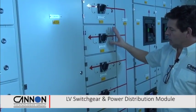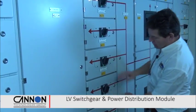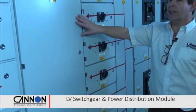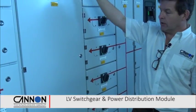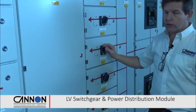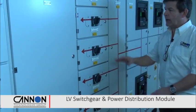These are our chiller outputs. And again, we've got a day 1 chiller output, day 2 and day 3. So all of this switchgear can be worked on in the live state. So we can add the day 2 chiller connections to the system. They're all fully isolated. So on day 2, we can just plug those in without having to turn off any of the critical systems.